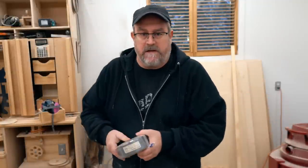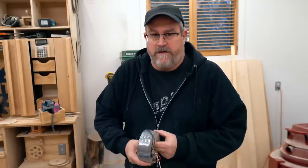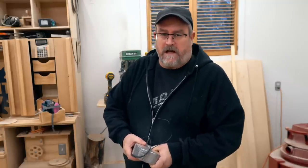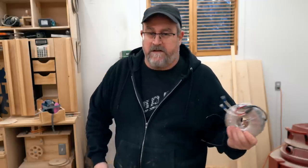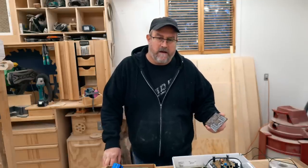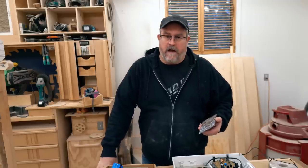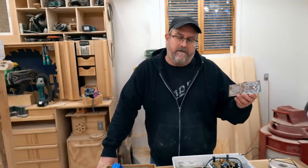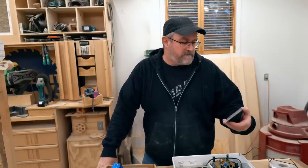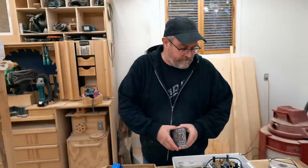The second part of this video is me talking about building an amplifier. Building amplifiers is something I was very much into a bit more than ten years ago. I built a few and designed the boards — based on other circuits, of course, because when it comes to audio amplifiers there's nothing new under the sun. One of the ones I settled on is actually from a Luxman amplifier. It's known as a folded cascode, and it's quite popular among DIY amplifier builders. It's a little bit more complex, and the thing that stands out about the one I put together is that it uses thermal track transistors.